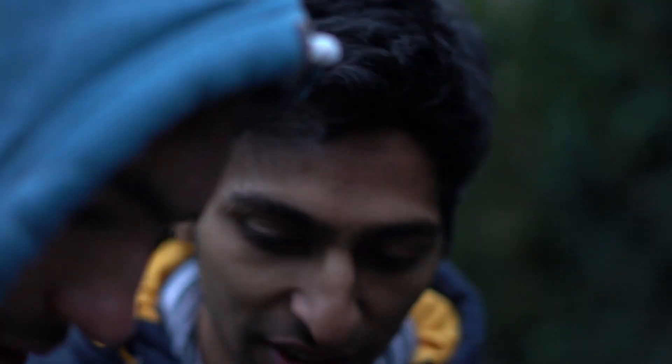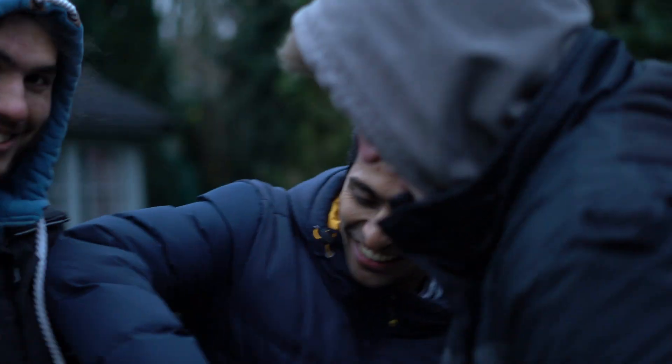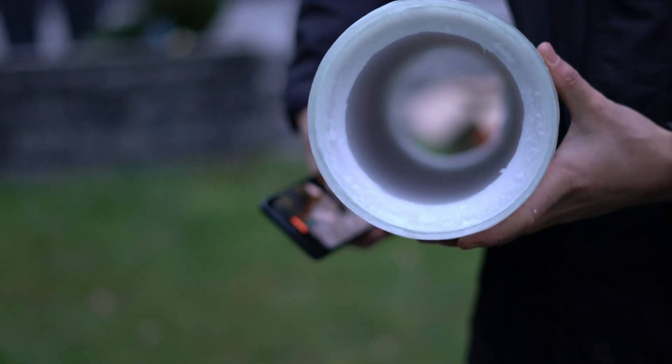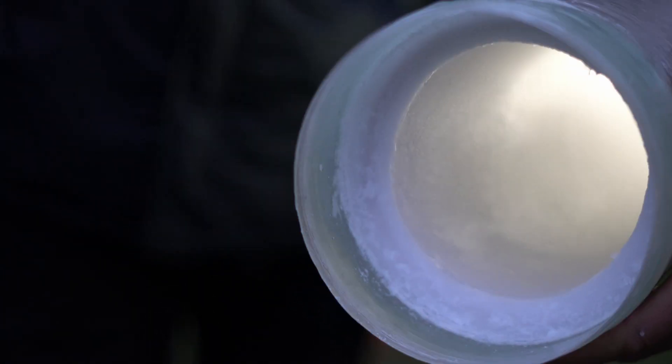Beautiful. 3.6 degrees — yeah, that's good, totally cool. Whoa, that's smooth. You can see here that we have a perfectly smooth surface on the paraffin wax — it's perfectly cylindrical. This is because our RPM was high enough to generate the centrifugal force that kept that cylindrical shape while spinning. It was also really nice that the cold weather helped cool the paraffin wax down a lot quicker — it only took about two hours, whereas in summertime it was taking much longer. Here it went all the way down to three degrees in just two hours, which is absolutely fantastic.